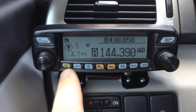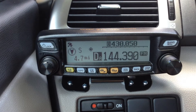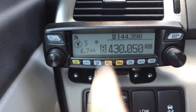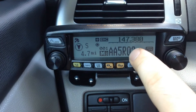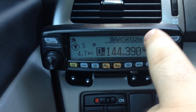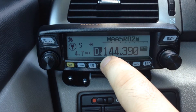I don't have it in dual watch right now. I could put it in dual watch — press and hold to switch the bands, hold on, press and hold and you go into dual watch mode. So every depending on your interval it checks the VFO up here, which I don't have set on anything useful right now. Let's set our club repeater and go back.